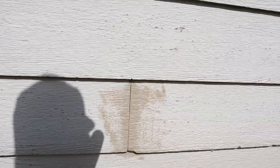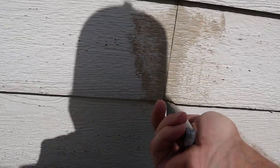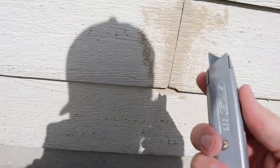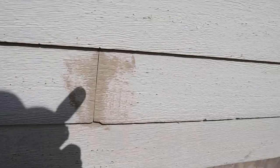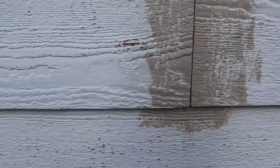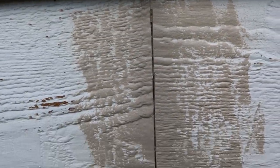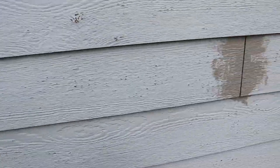And you can see these little bitties, these skinny cracks are quite hard to not get filled. So what was the trick? Took my little utility knife and went up the crack with the blade and wiped out the paint. Now these big ones like this, I didn't have to do that with. These smaller ones I did. Now you can see that one's a little filled. And the reason I didn't get it out is because the primer bridged the gap.